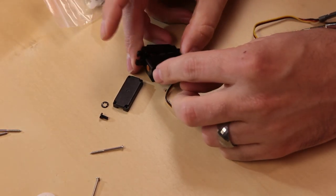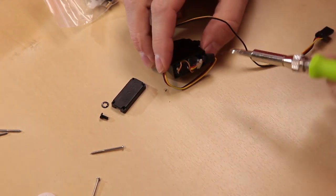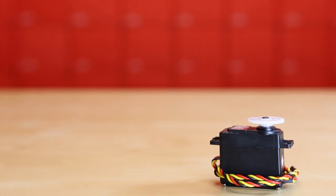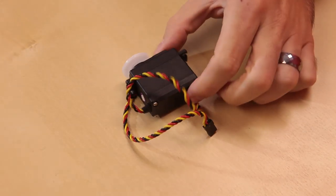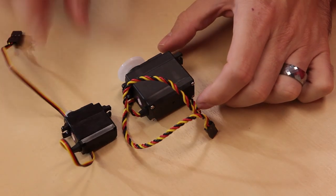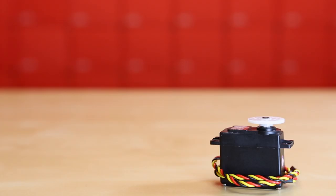You can see the actual motor portion down here, with the electronics hiding under there, and somewhere in this section is the feedback potentiometer. Next up, we've got a slightly bigger one — the HS625MG. The smaller one had 42 to 49 ounce-inches of torque; this one is 76 ounce-inches, so it's almost twice as powerful. But as you can see, it's quite a bit larger as well.